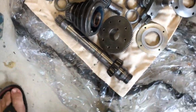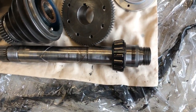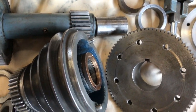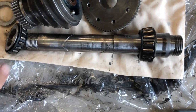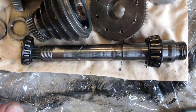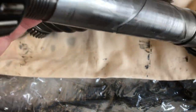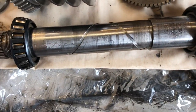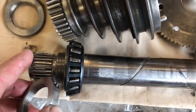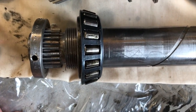This is probably the most important component - the main spindle. It's on a tapered roller bearing, and there's another roller bearing at the other end. They're tightened up so they're firm but still free to run and not going to wear badly. There's a thread on here, and when we put this ball bearing race on, you then put one or two of these locking rings behind it - they're really just nuts but without any hexagon. They go on this fine thread here for adjusting the tension on these tapered rollers, and one acts as a lock nut.